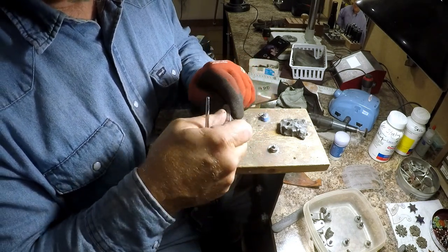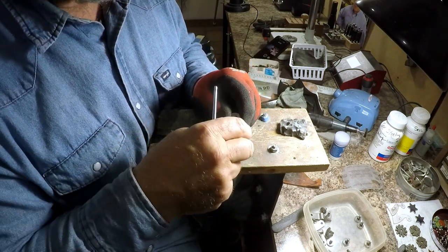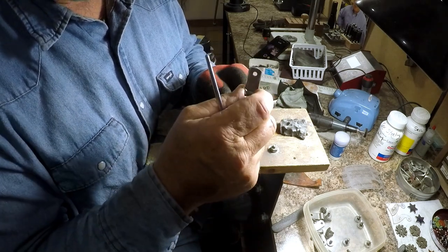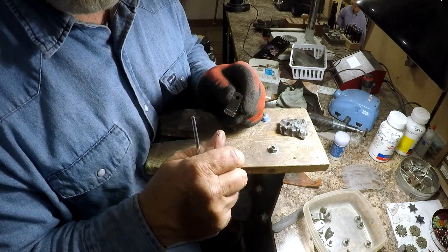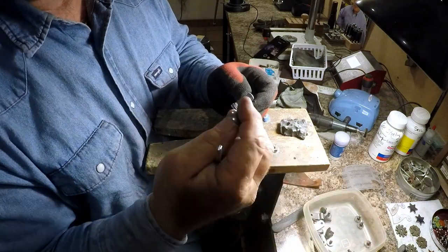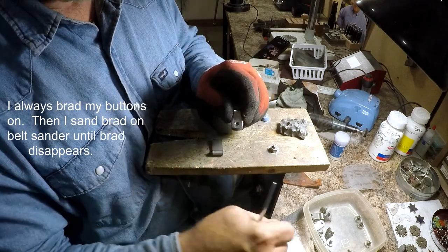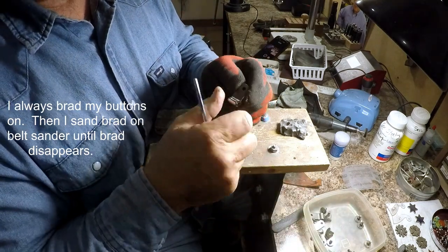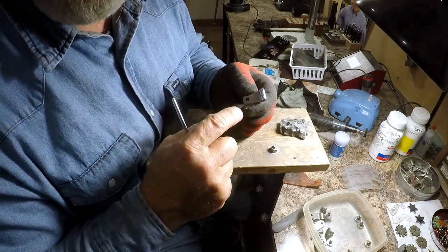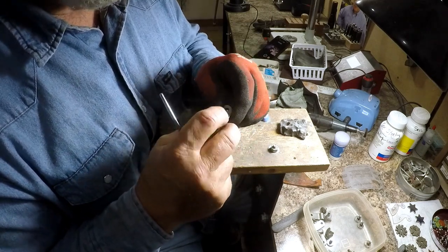the best I could. Now when you go to put this on the spur, like I said, we'll put a wedge in here, open them up. The last thing we'll do is we'll put these on after we've polished the spur and everything, and we'll close them back up, and we'll put the button in them and brad it here in the bevel side. And what we will do is we will protect our new finish with some blue masking tape, just so we don't scratch up our finish.